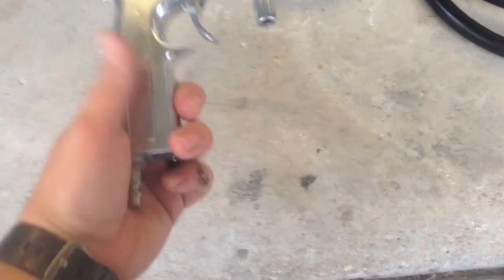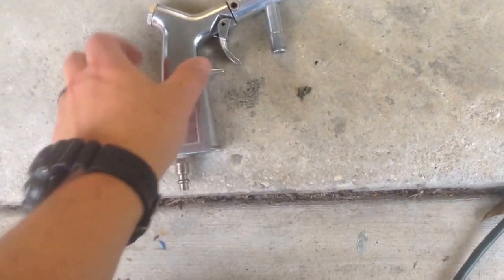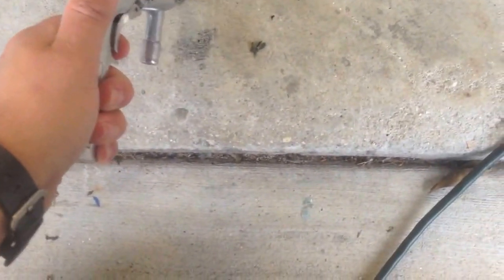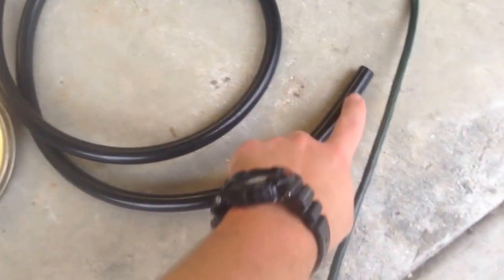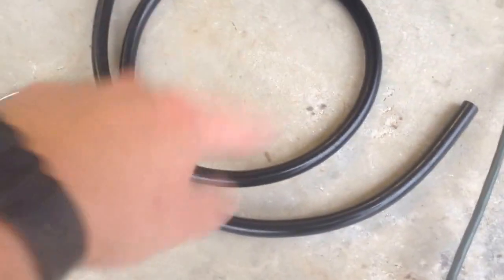Sorry — my phone died in the middle of making the end of that video. What I was saying is that you put oil in here in your inlet. I put a little bit of oil in here once I took this apart, then I connected it to the air hose and just blasted any oil that was in there. If you can point this at the ground and you don't see that little slick of oil, you're good. You took that out, you blew out any water that was in here. Don't connect it here and blow it through because then you just wet everything all over again — just put it near the tip and blow all the water out.